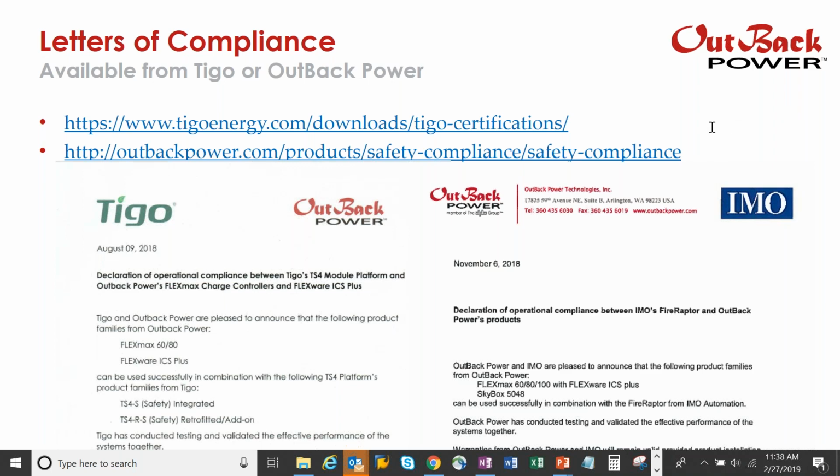Does the equipment have an available fault current rating? Can the AFC rating be series rated to higher values? You mentioned AFC, so by fault current, I assume you mean arc fault current rating, series rated to higher values. I'm not sure, Eric, if you're asking in regards to the sensitivity of the AFCI device in the combiner. If that's the case, I will have to ask. I'm not sure if we would be able to adjust the sensitivity on that device in series, but I'll go ahead and make a note of this and reach out to you when I find an answer. That was an interesting question.